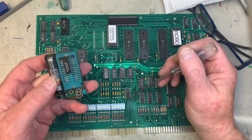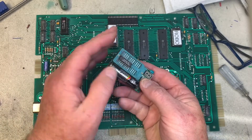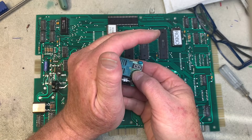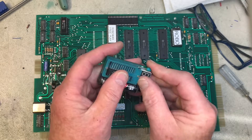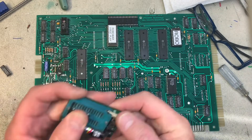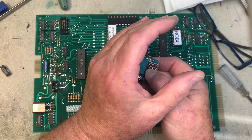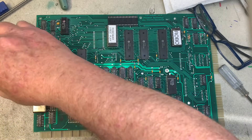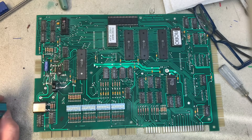The two chips I removed — this is the 7404 — went into my chip tester. Shading it so you can see the error code: ERR. That one is definitely bad, as the Chinese chip tester always identifies bad 7400 and 7404 chips. So those two chips were definitely bad; into the trash bin they go, and over to the game to test.